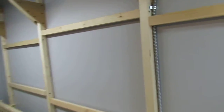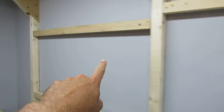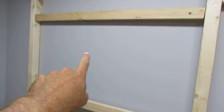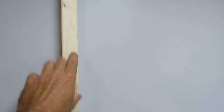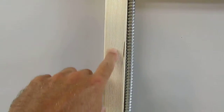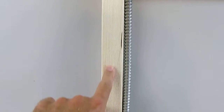And my plan is basically, I laid it up here earlier, and starting, give you some perspective here. Okay, so starting right here at this pilaster, from here down with about a 1.5 foot radius, coming back in tangent straight into this pilaster, it's about 8 feet. So I'm hoping that my seams for the hardboard will fall. At least this one will fall right here on this pilaster, which gives me a nice 2-foot section of wood to attach it to.